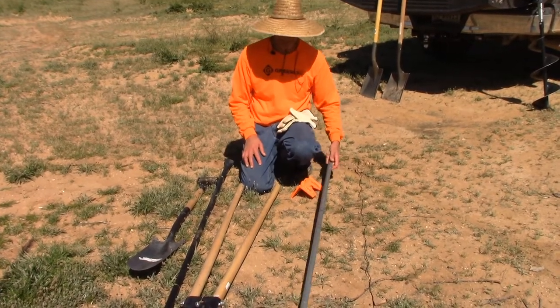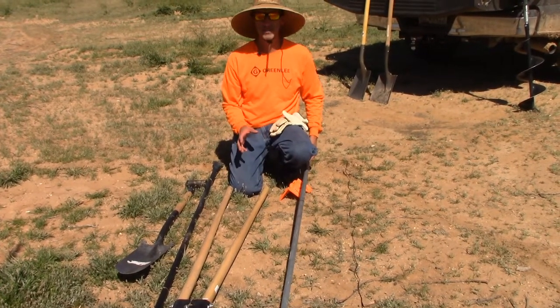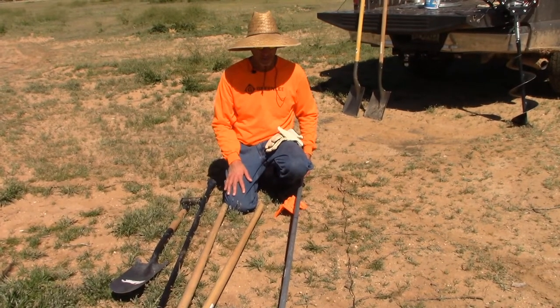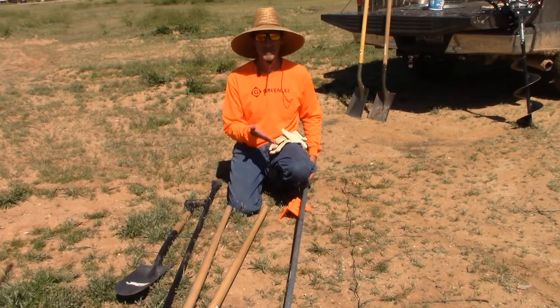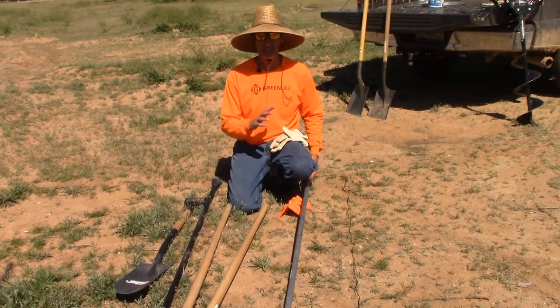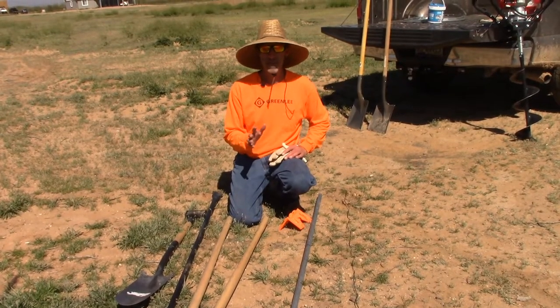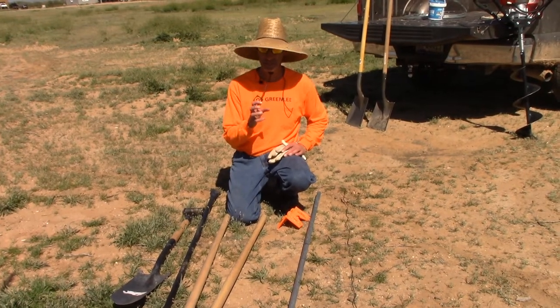Now, as far as distance, I've got an EMT pipe, couple markings here. Our goal right now is to get down to around 3 feet. In our test, we were just shy of that, so we figure if we can get 3 feet down, that gives us a 5-foot post. All of our T-posts are also 5 feet, so that'll give it a nice clean look. And with our hard caliche ground, we shouldn't have an issue with the post itself. That caliche is gonna basically solidify again.